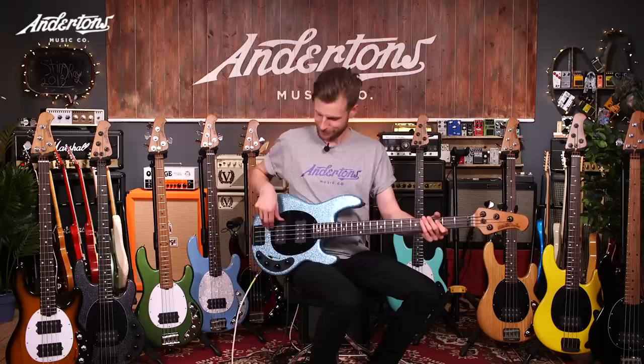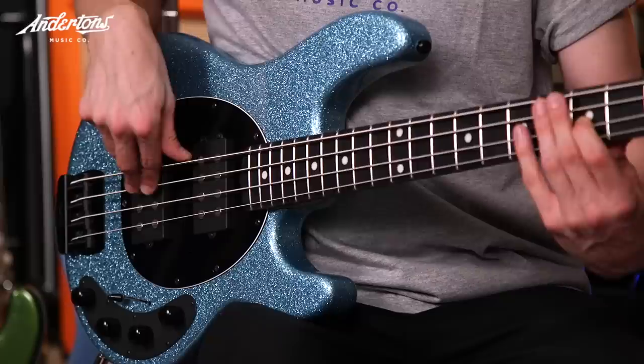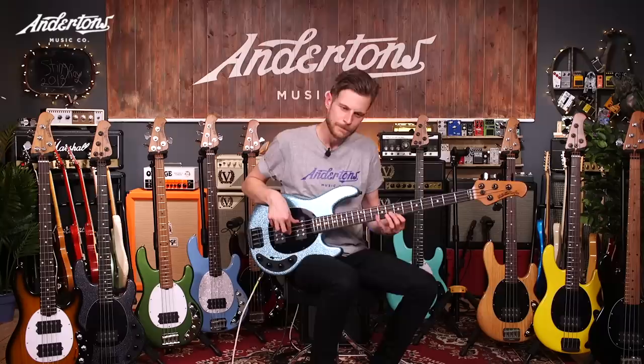This is when you can start playing around with the tone. So obviously for bass, if you want to bring out the bass, this is probably going to kick it because of the 18 volt now. Yes, that big, big low end presence. I'm going to roll that back to 12. This is your mid frequency. So if I put it on 4, you can hear that extra bit of definition and that higher mid range popping out. If I was to take that away, still sounds lovely, but you can tell it's missing something. If I bring that back in, just up to 12.